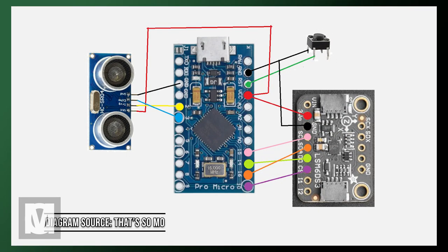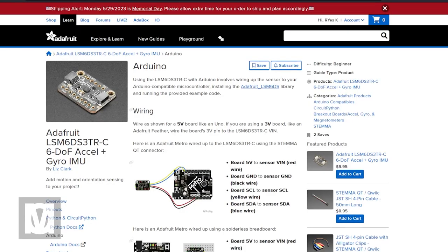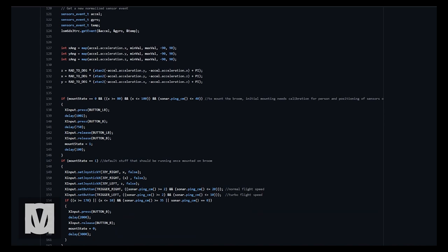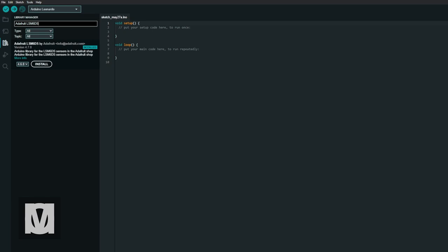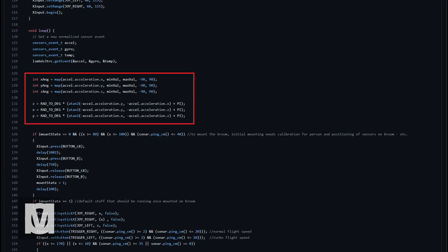Here's a wiring diagram of how I connected the sensors to the Arduino Pro Micro. I utilized the Pro Micro's SPI connection for the Adafruit accelerometer because I wanted to leave the I2C connections free in case I wanted to add more sensors. The wiring diagram can be found on my GitHub — link down below. I started by getting the example code provided by Adafruit for the accelerometer sensor and removed elements that were unnecessary to my goal. I also implemented the required setup for the ultrasonic sensor and the Arduino XInput. In order for the code to work you need three different libraries installed: the Arduino XInput, the Adafruit accelerometer sensor, and NewPing for the ultrasonic sensor.